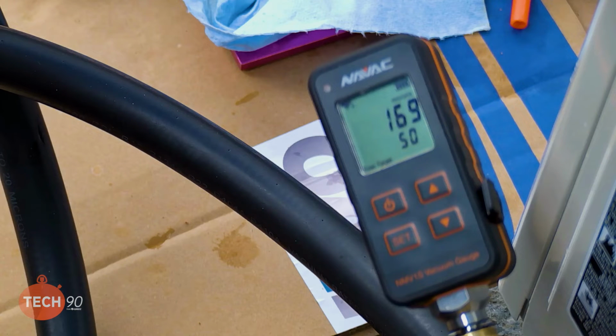That's a huge difference in what atmospheric pressure is and what we need inside those pipes. Did you hear the tone of the vacuum pump change? I did. As it's getting lower, the tone's changing. Well, I've actually had people tell me you can just listen to the tone of the vacuum pump, then you know whether or not you're in a deep vacuum. I'm sorry, but it's still not the same as measuring it with the right instrument. It's not the same as seeing on the vacuum gauge what the micron actually is.